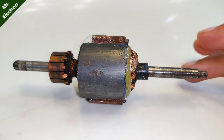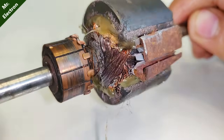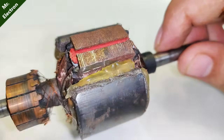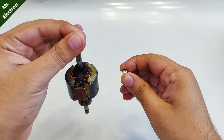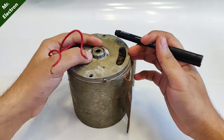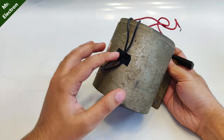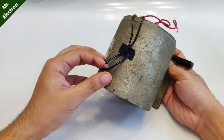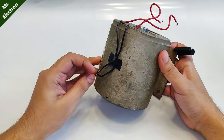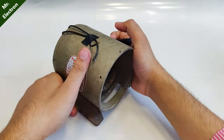What you see is my custom-made rotor field from an old DC armature, and the magnets are from a 775 small DC motor — not the strong neodymium ones, only the ferrite magnets — which I'm using here to induce EMF in the armature windings of the induction motor. I've placed a bearing and the black wires are taped on the yoke. I'm going to measure the voltage from these two wires.